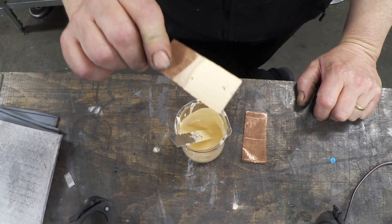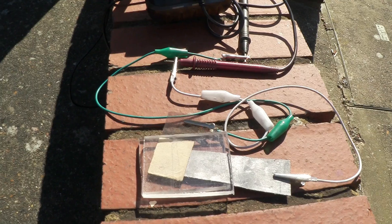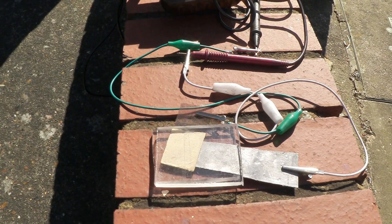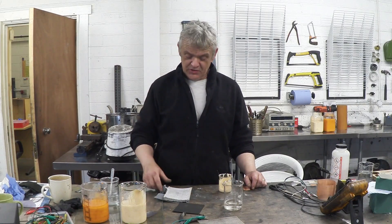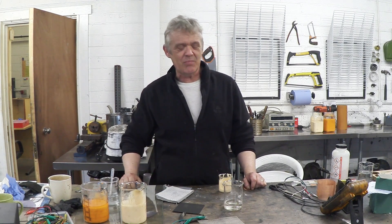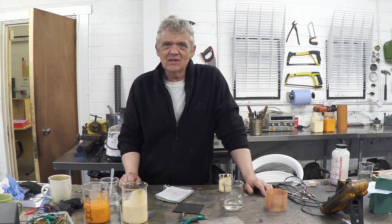There's our little lead cell sitting in the sun. We've had to do nothing with that apart from painting it on the copper — there's no electrolyte in there and no cooking at high temperatures. You just paint the yellow lead straight onto the cell, giving us 0.22 of a volt — about the same as the copper oxide cell. So you take the insides of some batteries, cook them in the oven to turn them into yellow lead, make a paint out of it, paint it onto some copper mesh, and you'll make yourself a solar cell that performs better than a copper oxide solar cell.